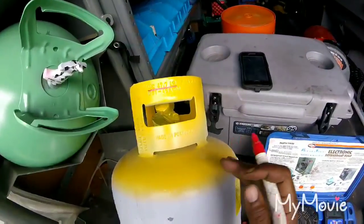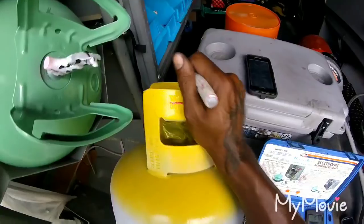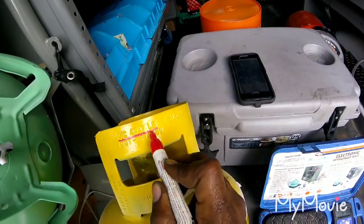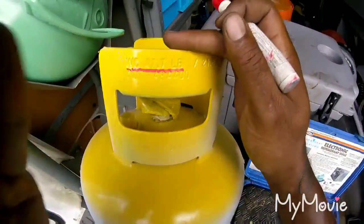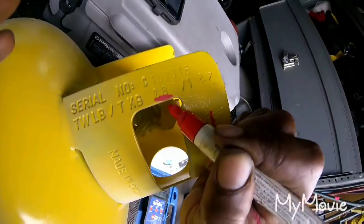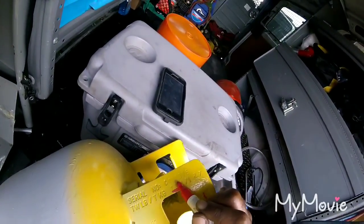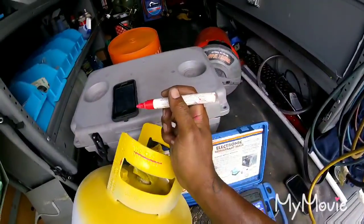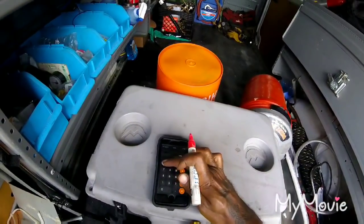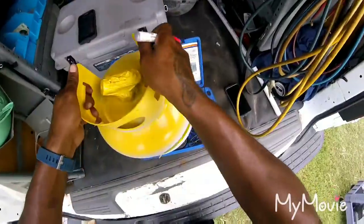Hopefully I can put some more in and use another drum, but I never go over 40. I put 50 in it before — if you do 50 and the drum is 28, the whole drum is going to weigh like 78 to 80 pounds. The WC is 47.7 — that's the max refrigerant you can put in here. This 28 right here, that's how much the drum weighs — that's the tare weight. All of them have a serial number so it can be traced back to the manufacturer. So 28 plus 47 — that's 75 pounds. If you fill this up to max, it's going to be 75 pounds.